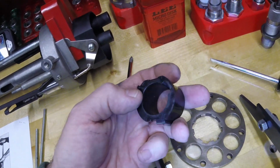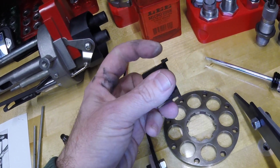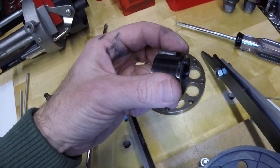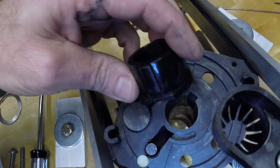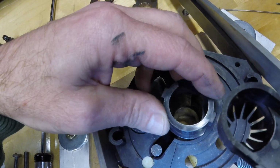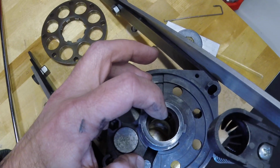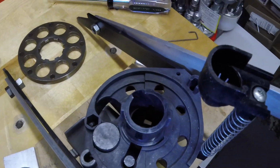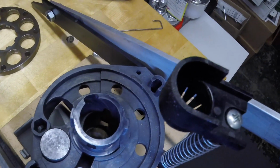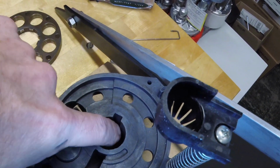The other thing is it's got this pin on the bottom. I don't know if you can see that. Yeah, there it is. There's that pin. That engages this area here to make this only rotate. So you can see here when it's indexed there, it's lined up so that the whole carrier can, trying to get a good shot down in there. When this thing is on the shaft, the pin comes up that straight keyway.